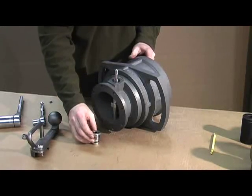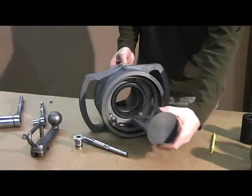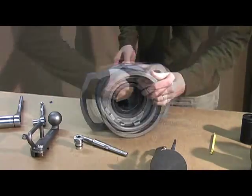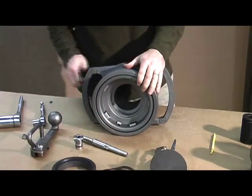You can remove your shaft, and with the shaft out, you can remove the poppet. With the poppet out, you're able to remove your cylinder, which gives you access to your cylinder seal and nose seal. It's that simple.